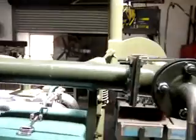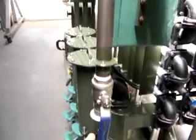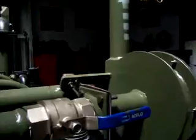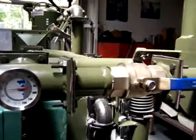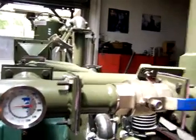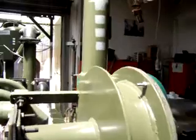From the screen filter it cruises across to a ball valve, keeps going, and breaks off into two at a T-junction. One line will take us to the generator, and the other section where this gauge is goes across to the air pump. The reason I've set it up this way is so I can draw gas through with the pump, and once the gas has come up through the system I can switch the air pump off and the generator motor can start drawing from here.